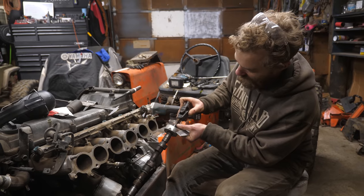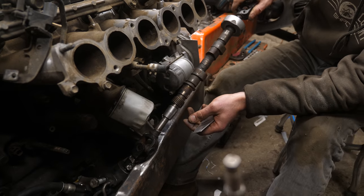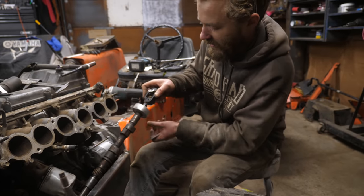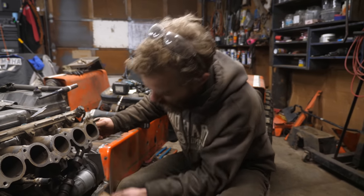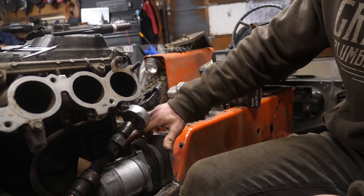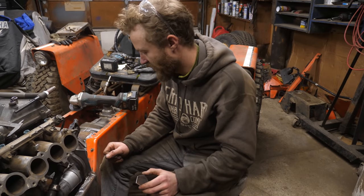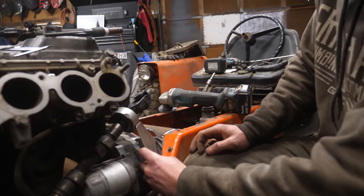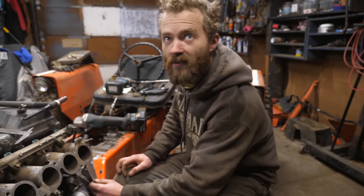I got this end all welded on. It's not welded to the chassis yet but the fitment is nice and tight so it holds snug - I'll just weld both sides and it'll all be one piece. I've got my bearing on here with a trimmed-down version of that bogey wheel, which is now just a housing for it. Now I'm mounting that to this plate using the two starter bolts. I'm using aluminum street sign scraps for the bracket since this is aluminum and I need to weld to it. The plan is to get it tacked, add some bracing, and then we'll have a steering column bearing mount bracket.